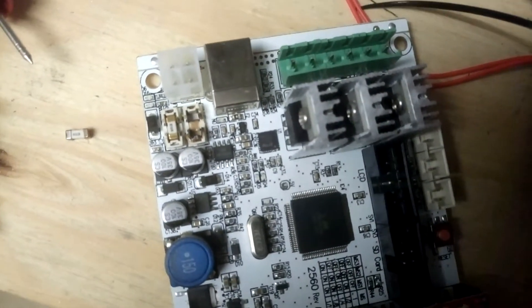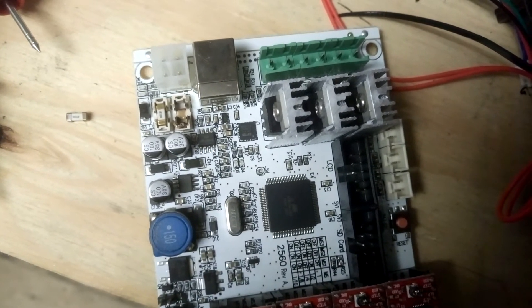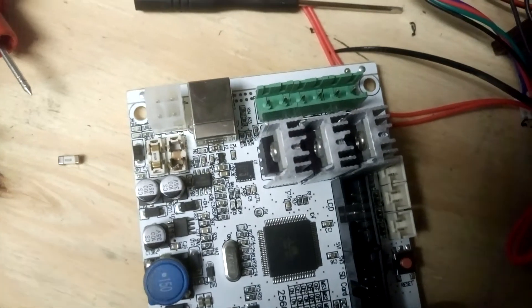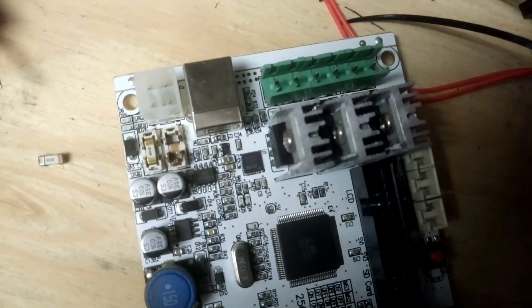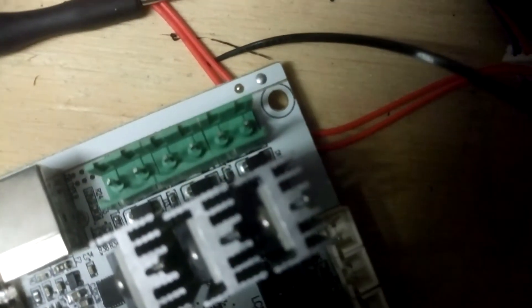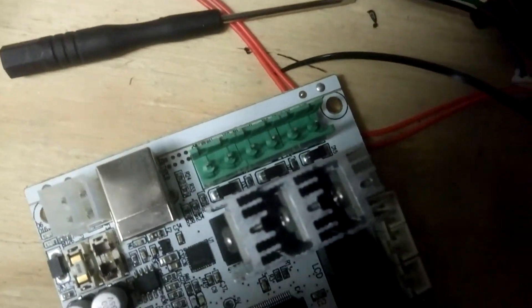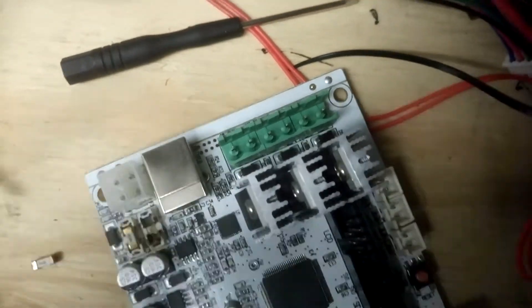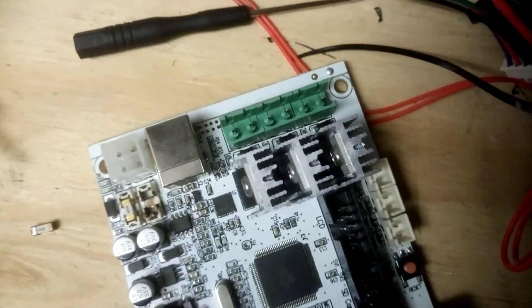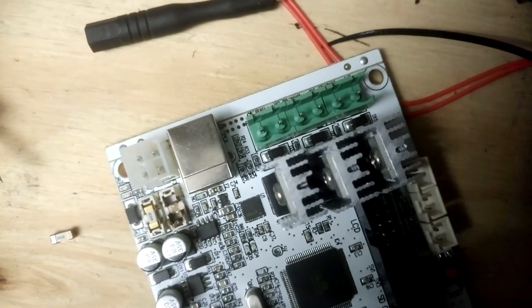Just be wary of these things - they're not toys, and they have the potential to cause some real danger. These green connectors can shimmy and wobble, and you get arcing between the contacts, then corrosion builds up, and that can lead to fire. I actually had this happen once on a connector block - I was joining a mains lead together on a PC with about a 500-watt power supply load.